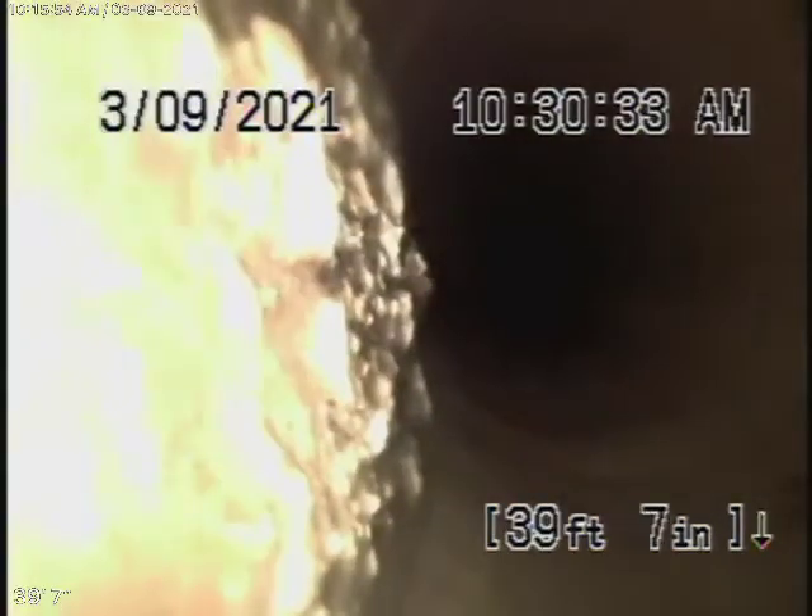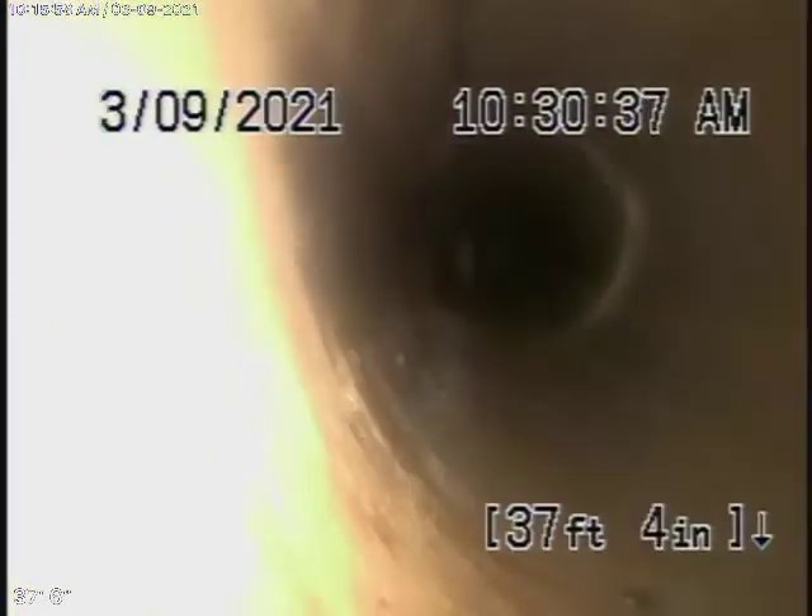It appears we have cured-in-place pipe lining, and at this time it's all in good condition. Just remember, if you ever have some kind of a blockage in the line — which is probably not going to happen — you never want to run a cable with a blade through a lining. But as of today, this is all in good condition.